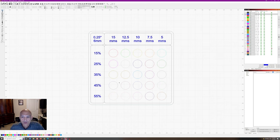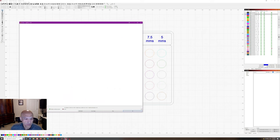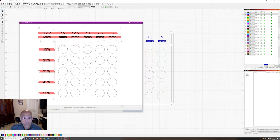If you want to know how long this is going to take to cut, you can look at the preview by clicking that little monitor icon. It shows an estimate of about 6 minutes and 55 seconds. Also look at the order that things will cut or engrave — first the shapes, then the text, then the circles, and last it cuts out the test card itself. That's based on layer order in LightBurn. If your test card cuts out before anything else, and you have the material on risers, it's going to fall and go out of focus before you even start cutting.